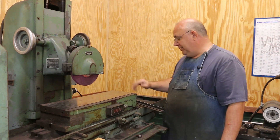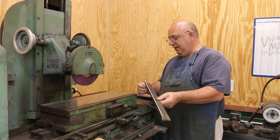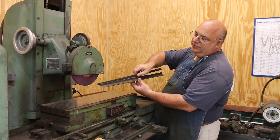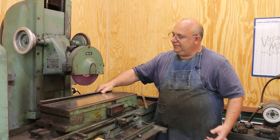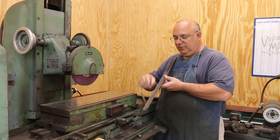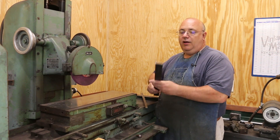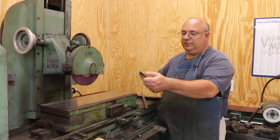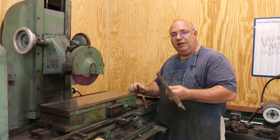So we're going to make a back rail today. What I've got is just a piece of angle iron — probably eighth inch thick by an inch and a quarter or so. I took it and actually cut part of this off because it was just too thick for the top. So basically this will be able to go down; there's some bolts on the back that kind of hold them in place and we'll be able to bolt that on. I just used the bandsaw at the museum — didn't do it on camera — but it's a little bit thicker than what I need. I'm actually going to take this over to the mill and clean this up because that's not nowhere close to a straight line. I also need to mill some slots in here — there's some holes in the back where you can adjust this thing up and down. So we're going to be over on the milling machine this morning, getting this done, getting installed, and then we'll have to actually grind it to get it parallel. So let's get going on this project.